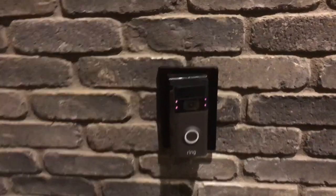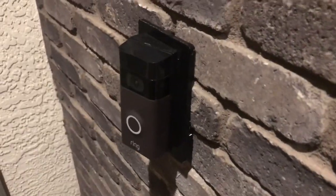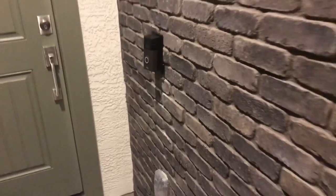I have the stuff mounted up. I wasn't able to get the wiring of the doorbell working — I think our chime may not be compatible with the Ring, so we might either have to look into getting a new one or just run without one. It does send you notifications to your phone, so I think we'll be able to live without it. I still really like the location we're putting it. This video was more about getting it mounted onto this surface anyway. Here's the finished product — the doorbell looks pretty good mounted on that bracket. You can't see any of the holes back behind where the doorbell is, which is what I was going for, and the wood covers up and fills in that gap fairly well.